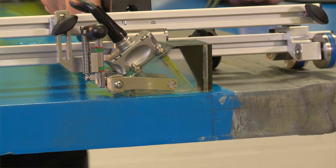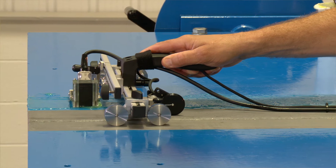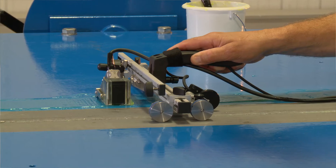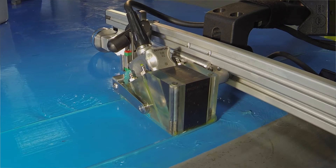The SWIFT is a good scanner for scanning volumetric defects within the weld, and phased array is a good method of ultrasonics for collecting volumetric data. To use phased array on heavy wall plate, primarily for speed, it's a very quick scanning tool allowing you to scan the entire weld — a very precise way of scanning a weld 100% in one go.